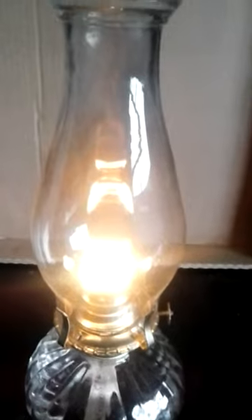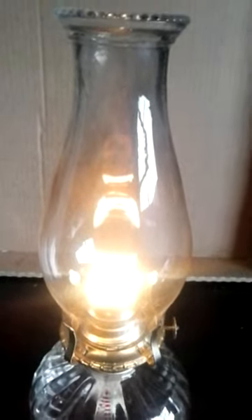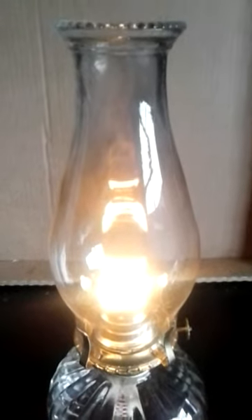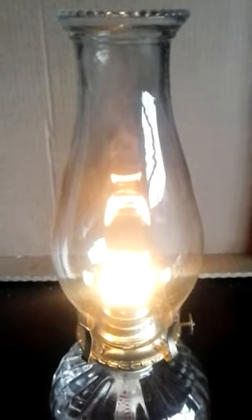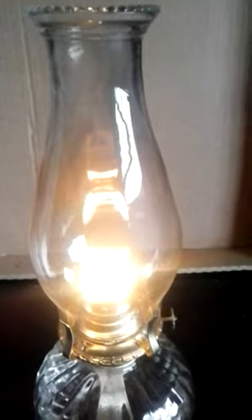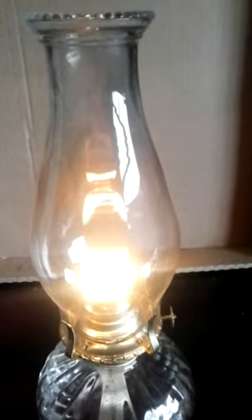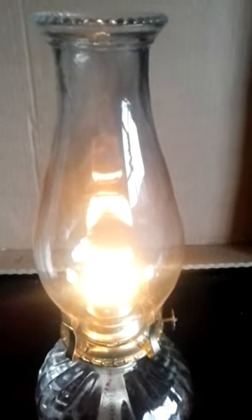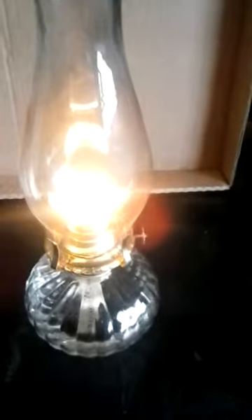I pulled the covers off. I've got a spare burner here. I pulled the flame spreader off both of them to see if I could see any difference. There were two different brands so I thought one's probably just a better brand than the other. But when I pulled that flame spreader off, I did notice something. I played around and this one now is a much, much better burning unit. I'll get the camera set up so I can use two hands and show you what I found and what adjustment I made.